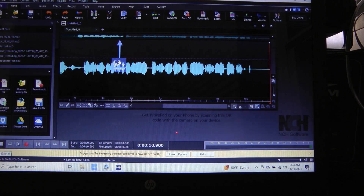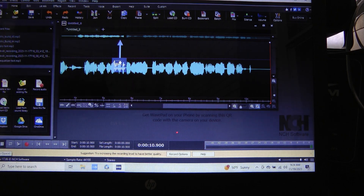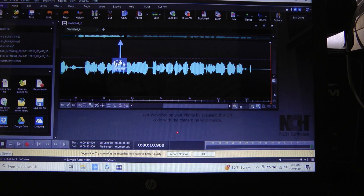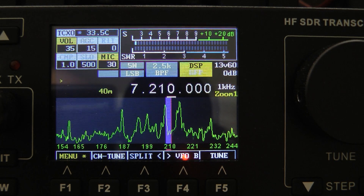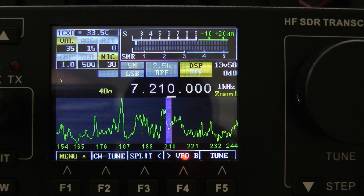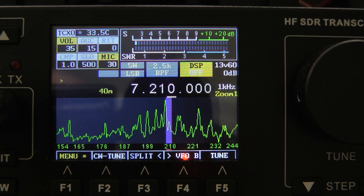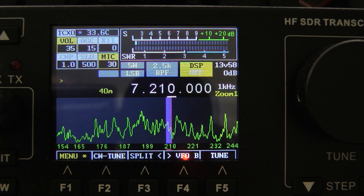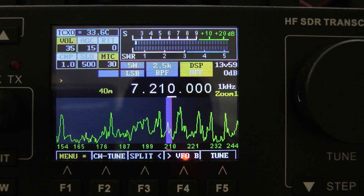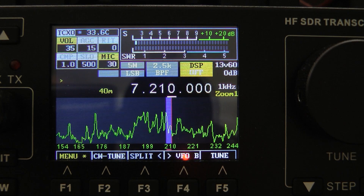I've said it many times in the videos I've made — I liked it in the 2.12.2 firmware, but I love the radio now with Nizer's 96 kilohertz spectrum scope and all the improvements he has put into this radio. Again, there's a link to Build 45 in the description. That recording may have sounded like it had a little too much treble and was lacking some bass — that's the way I set my transmit equalizer up because when you're operating low power, I think it helps to remove bass and add treble to punch through the noise.